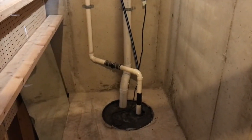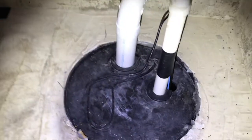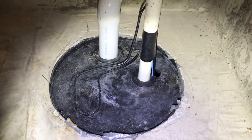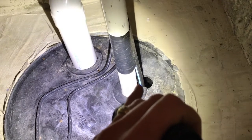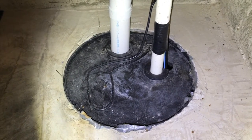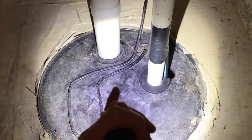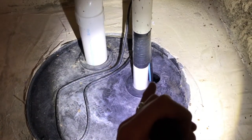Let's focus on that larger pipe. In most cases it will be three to four inches in diameter. Let's head over there and start with the black cap. As you can see, it is a solid black cap — you cannot see through it and the cap itself is pretty secured in that circular cutout. Notice that little hole where the additional pipe comes out. That would never be allowed in an active system install in terms of radon systems. This system is currently a passive install. You will also see rubber gaskets or seals that go around each of those pipes to prevent any radon gases from coming up out of this cap. Again, with that large hole there, this would never pass inspection for an active install.